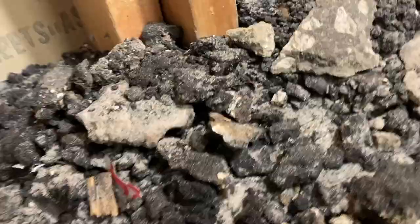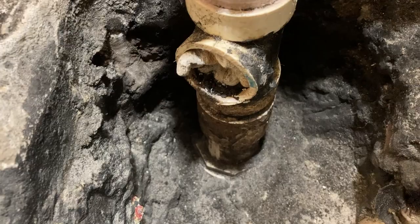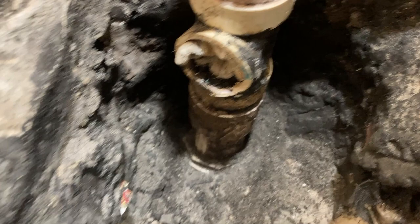But if any of you guys know, leave a comment down below and tell me what it is. It's some sort of tarry asphalt substance, probably to keep termites and stuff out. But all I'm going to do is fill it with play sand and put maybe about an inch of thin set on it. That way, if anybody has to get back into it, they can just take a hammer and smack that thin set and it'll break right up.